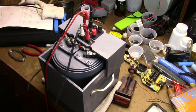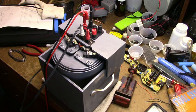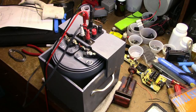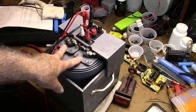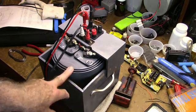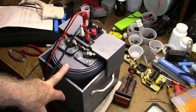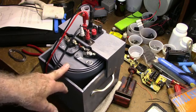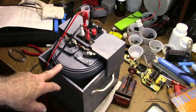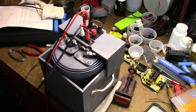So you have two ways to connect to the dummy load. If you make one of these, I hope you got some ideas from it. Each resistive element is two kilowatts. I still have to fill this with mineral oil — I had to order some because nobody locally had a gallon of it. Once filled, it'll be good for any amplifiers I work on. I hope this is helpful — if you want to build one, good luck, and thanks for watching.